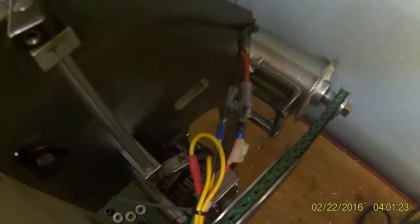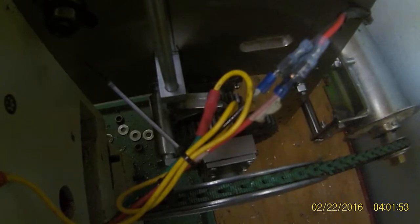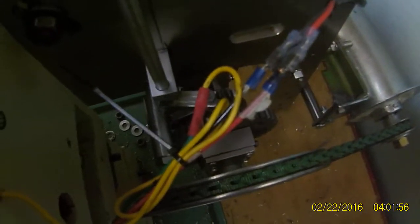There's my little ghetto gearbox and here's my shift mechanism. I milled a slot in there — you can see that. It's on a bolt and I use the bolt and washer so it actually stops it where I want those gears to line up. When I go all the way to the outside, it won't let that gear touch the outside wall, and same on the other side.